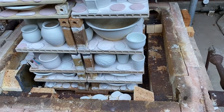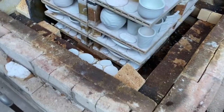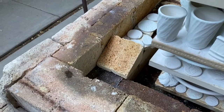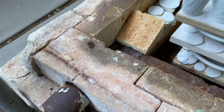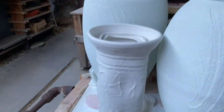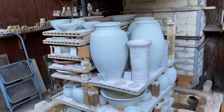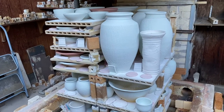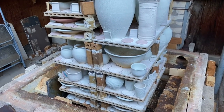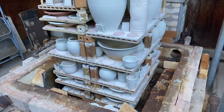And that presented some problems with getting the kiln to balance. And it's actually these bricks here, these soft bricks that are at 30 degrees here. So the burner comes in here, it hits that soft brick at 30 degrees and deflects the flames up. And I was given that tip by somebody in LA that I was talking to years and years ago when I worked here with Tony. And it worked. Kiln's fairly even. Before that, it was a good cone and a half, sometimes two cone difference between the top and the bottom. It's a downdraft kiln.